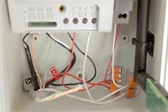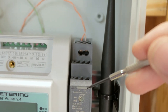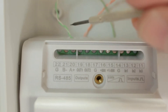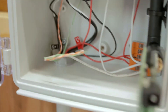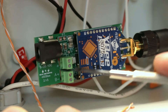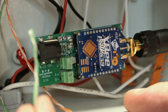Coming up to the top of the power supply, we have V positive and V negative. Our 12-volt DC positive is the orange line on the left, and our negative is the white line. For our communication side, we have B negative on the white wire, and A positive is our green wire. Now we'll hook up our twisted pairs to our 485B. On the 485B the top connection is our power supply — negative and positive — so that will be our orange wire. On the bottom we have A positive and B negative, which is our communication wire.